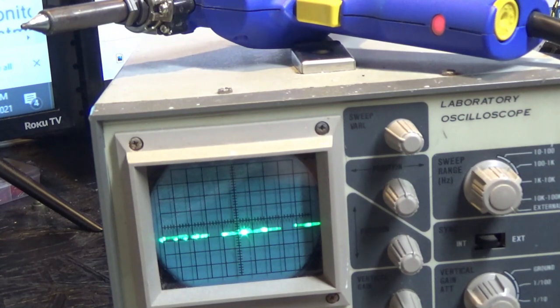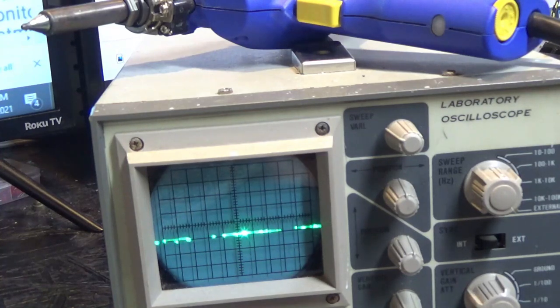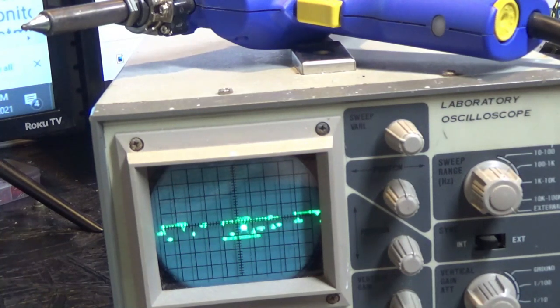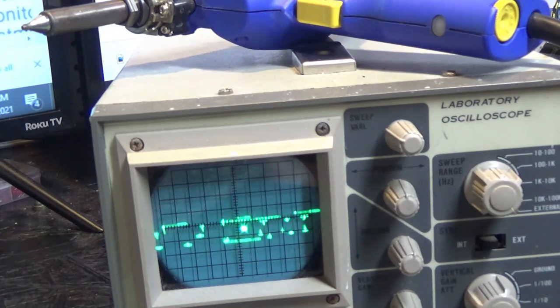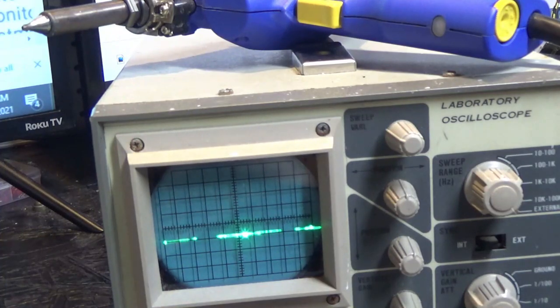And I'll go back to this guy. Slight. Ooh, there we go. If I lick my finger and touch that. There we go. It's coming back out some. Which changes the gain of the op amp a bit. So, I guess let's replace this bastard.